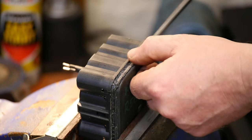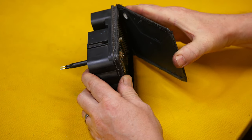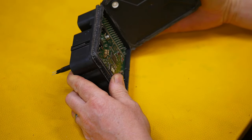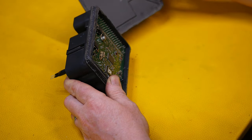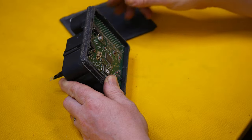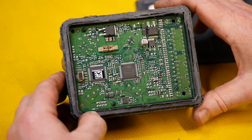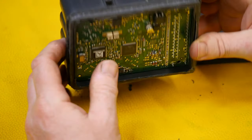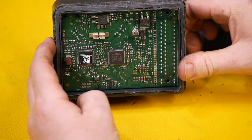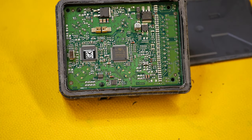Still tidying it up a little bit, and I think we can take that to the bench now. I'll pop it open — it's still stuck on the right hand side so I'll just twist that carefully so I don't break it. And there is the control module. We can see two big pins there which are the ones going to the motor, and it does seem to be correct as reported on the internet that those pins are not soldered. So the next job will be to get the soldering iron out and start soldering.